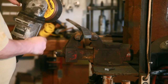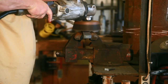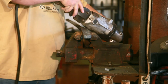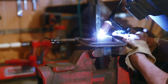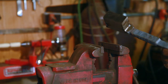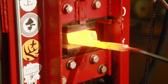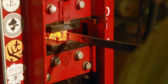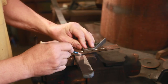I like to use these cup stone wheels — this thing is outstanding for removing forge scale. There's a link in my description if you'd like to get one. Got her cut and restacked, which should give us 80 layers. Just fused them together, squeeze them together, and draw them out again. We'll do another cut and restack.